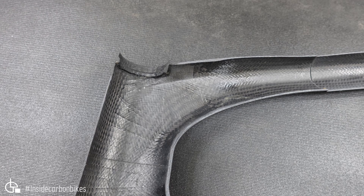The upper junction is again similar, not much to make note of. The upper bearing seat is the same as the lower end and also the bottom bracket — they'd have a one-piece mandrel going through so everything's concentric and aligned. Once you inject, it's all good. You can see the join through here for the top tube to the head tube material.